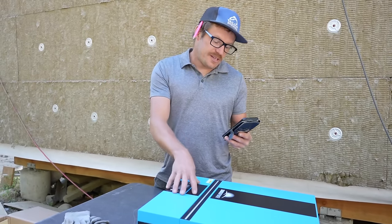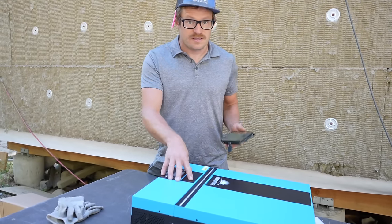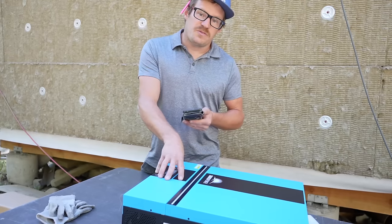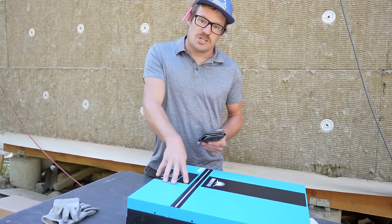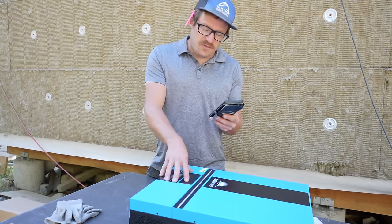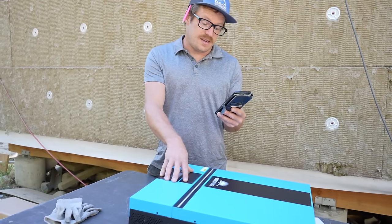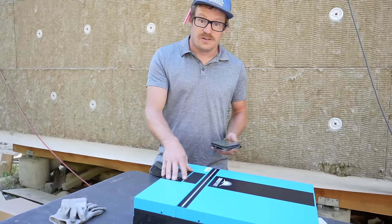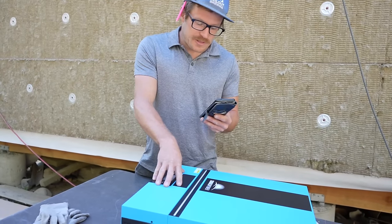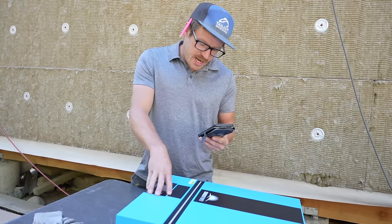It has a utility battery charger max of 120 amps, which is why we're super excited — we don't get a lot of sun in the winter. It has a max PV input of 250 volts, though their website says they'll be changing that in September to 500 volts, so it's a high-voltage unit with dual PV input. It's UL 1741 standard, listed by TUV, CSA, and FCC, so it's licensed for use in Canada. It supports up to six units in parallel.